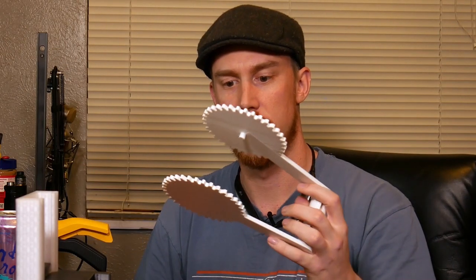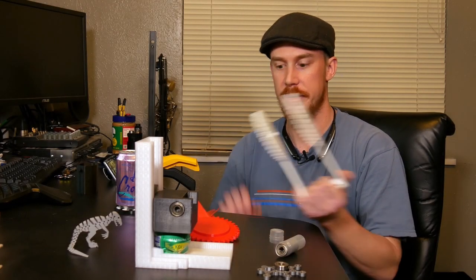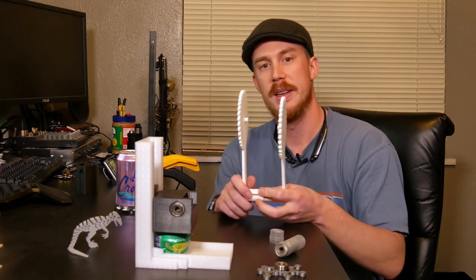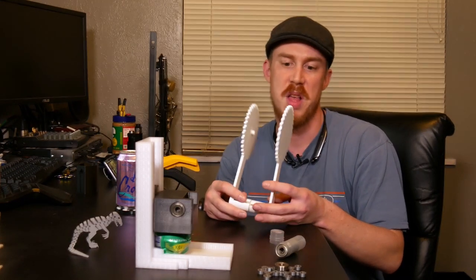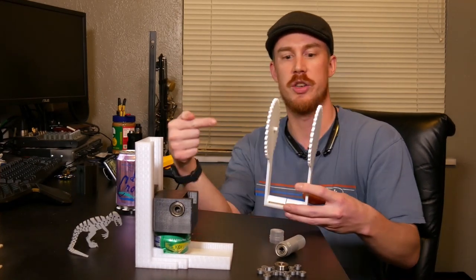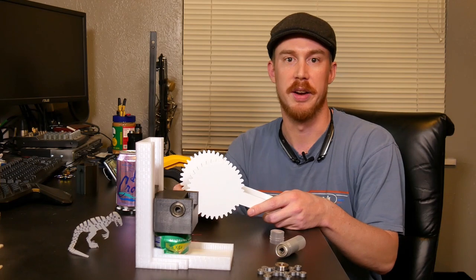Okay, so some final thoughts on this design. The pegs which hold the handles into the crushing block are weak. They are a constant point of failure in my experience, especially in the wall-mounted version. They're way too weak to use PLA. This is basically garbage now. The latest handles that I've made, I've printed with PETG, and so far they've held up. We'll see how that goes. If these fail too, I'll give it a try in ABS before I just drill through this and the crushing block and just shove a big metal rod in there to hold it together.